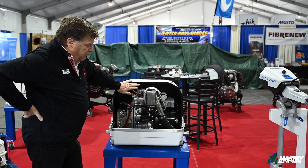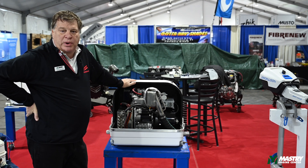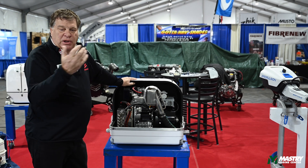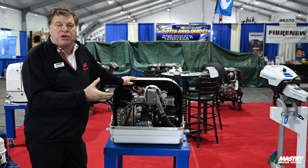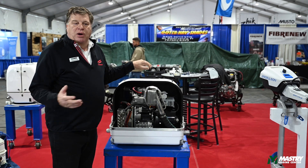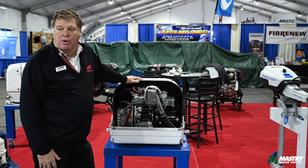This unit here on our VTE 4000 is rated at 3.2 kilowatts continuous output — that's about 28 amps of power, continuous duty. Most generator manufacturers rate theirs at intermittent. You have to look at the fine print when buying a competitor's generator and see what their continuous output is, and that's what you should base your sale on. We sell this to cover a 30-amp breaker, for boats from about 28-foot up to about 40-foot, depending on the equipment they have on board.